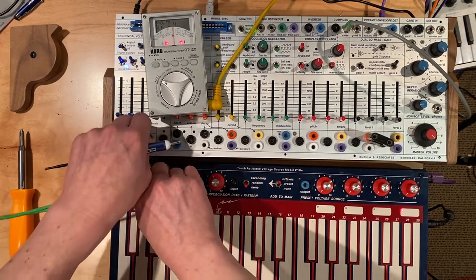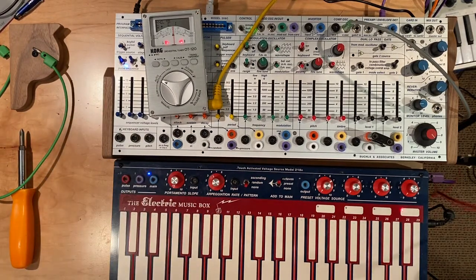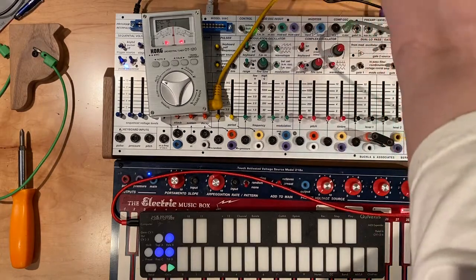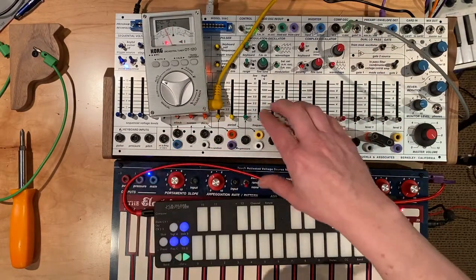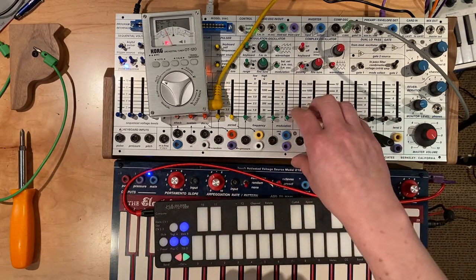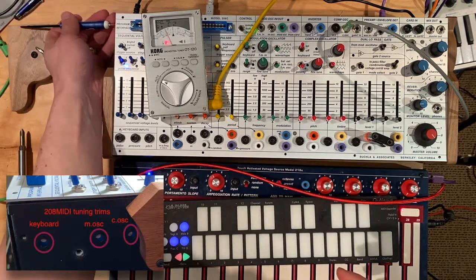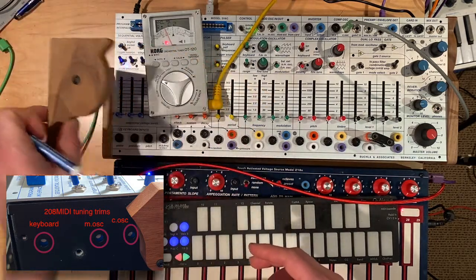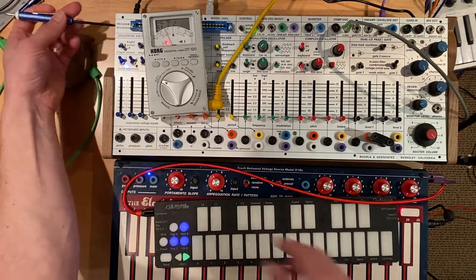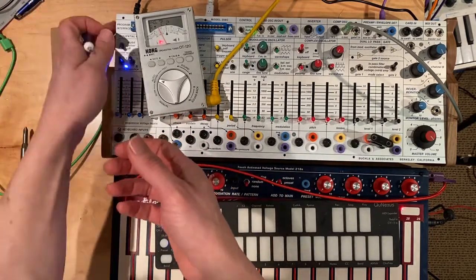Now let's do it with MIDI — MIDI is the same. We want to make sure MIDI obviously works equally well. I'm going to use a Q-Nexus here. This one actually hasn't been through the factory; this board was installed separately, so this is particularly interesting. If you installed your own 208 MIDI board into a 208c that did not have it previously, you might have to tune this. The top trim on the side is right over here — you'll see a hole. If you remove the side panel, there is a hole you can access with a slotted trim tool to adjust the tuning to match.